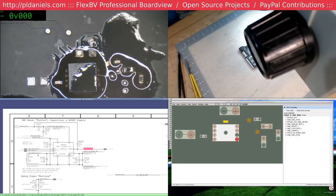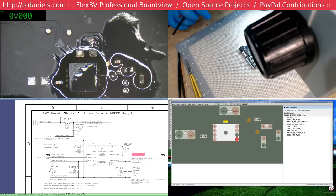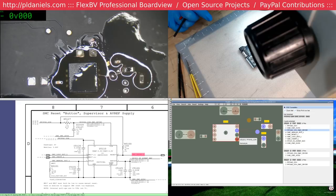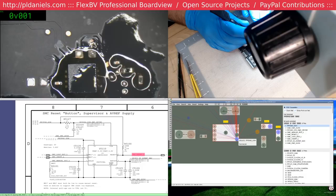Let's test the fundamentals. So up the top we should be getting 3V42, so we'll test that for V input. It's pins 1 and 3. Okay, 5127 is just a 0, that's a no stuff, so that doesn't play into it at all, so we just want pin 1. Okay, pin 1, do we have 3V42? We do.